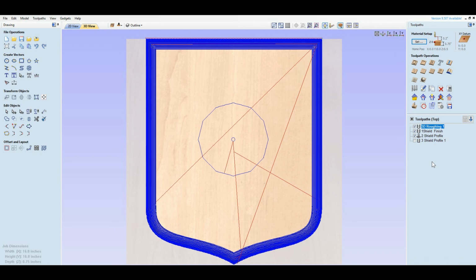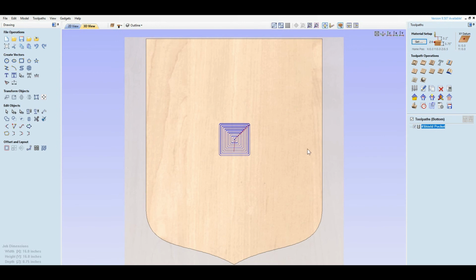So after we've got done with all of those, you save everything to your files, and remember that your 0 position is the material surface. When you flip it, make sure you flip it on this hole. The hole is aligned, and really the only thing that we're going to do is, if you remember, when I flip it, all I'm doing is putting a pocket for the mechanism in. When that's all done, that's all there is to it, and you're ready to go into the machining portion of it. Now we can take our files over to the machining portion.